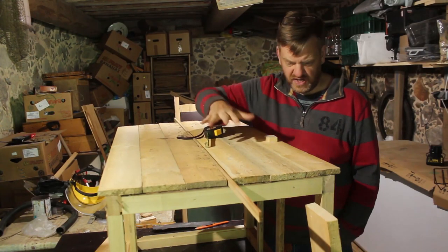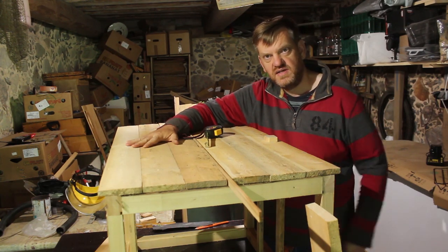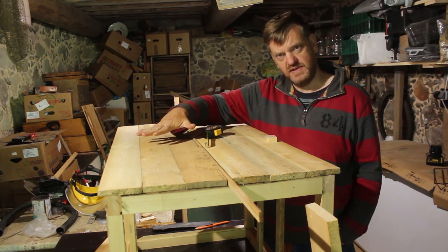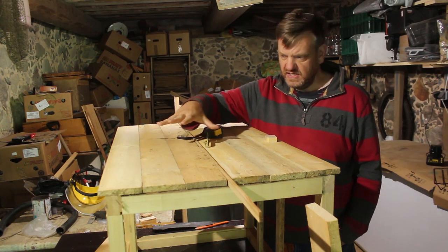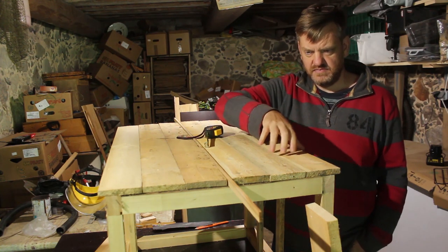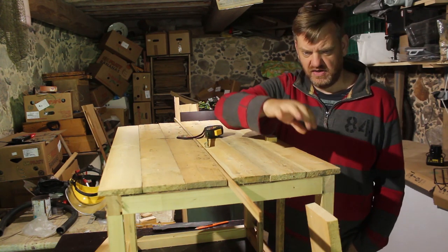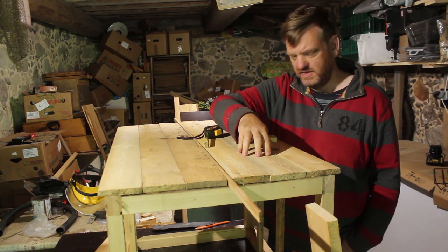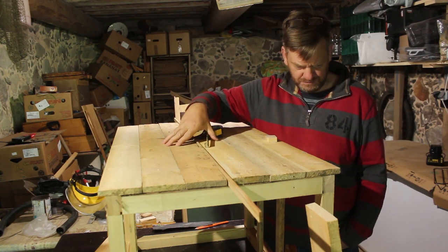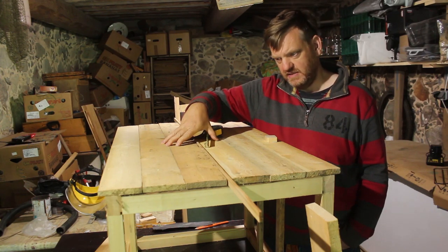So we've got the frame made and we've got the sliders on for the shelves, as you've seen. We're now going to put the panelling on around the box. I'm going to do the back first. I've got these planks here, which are 10 mil by 90 mil. Everything's in metric here. I'll get those on the back.